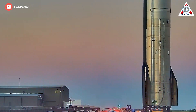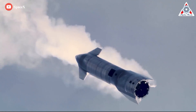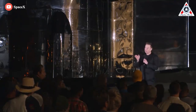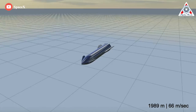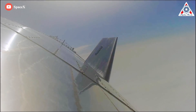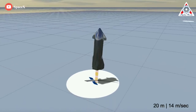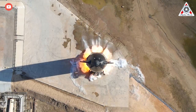There are also small but visible changes to Starship's forward flaps. Much like a skydiver can tweak their body, arms, and legs to control orientation, Starship uses two pairs of forward and aft flaps for similar control. To improve the moment arm of the forward flaps and reduce undesirable aerodynamic characteristics, SpaceX is shrinking those forward flaps, moving them closer together and more toward the tip of the nose, and angling them toward the leeward side. This means a portion of the flaps will no longer be directly subjected to re-entry heating, potentially allowing SpaceX to remove the static aero covers that protect sensitive components from superheated plasma.